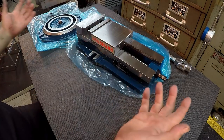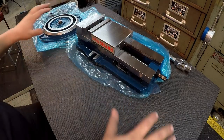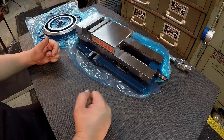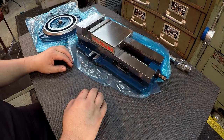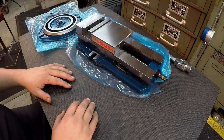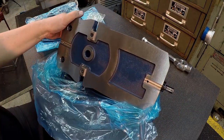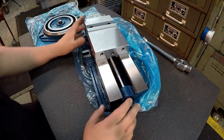This is just out of the box — I haven't even cleaned the oil off yet. What I'd like to do is clean them off real good, clean the granite plate, and set it down on here and use my own indicator to see what kind of readings I get. This is not a guaranteed granite surface plate — I haven't had this thing inspected or lapped — so my readings could be different than what the spec sheet says, but I want to do it just for fun. Checking the bottom of it — it does have the keys as well, which I wasn't expecting.